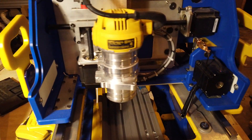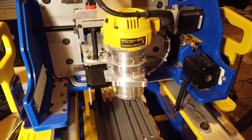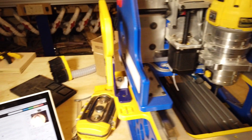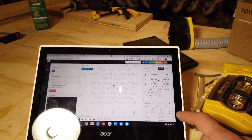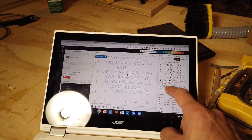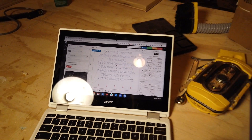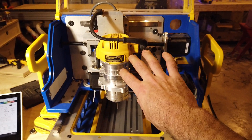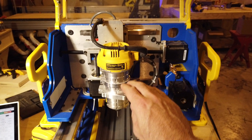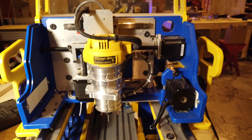Do a little jogging here, moving around — it's very lively. Everything works great. It has a real machine coordinate system, which is really nice. So you've got your physical machine position and then wherever you're zeroed out on the job. That lets me do things like zero out on a job while being zeroed elsewhere, and it will always remember where the top is or won't over-travel and hit the end stops.